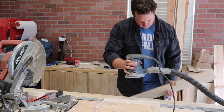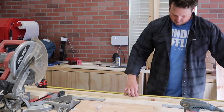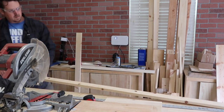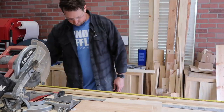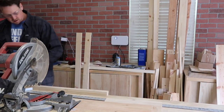Try to do as much sanding off the wall as possible — it's much easier and it's going to save you a lot of heartache. After I sanded the sill, I moved on to cut the apron, then the sides, then the top, the header, and the crown. I'm using a Ryobi orbital sander with 320 grit sandpaper. The boards we buy come pretty smooth but the 320 grit makes them even better.